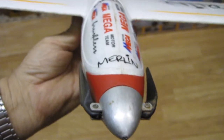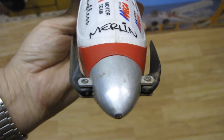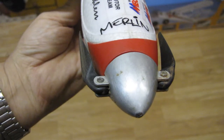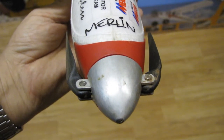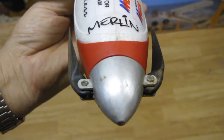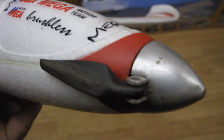The motors I've got - the specifications are Mega Motors 16-15-3 and a 16-15-4. I've used both and they both fly very well. I've got the other one in a mini XE flying wing. The 4-version runs at 2100 kV and the 3 is 2800 kV, so it's a fast motor. They're not cheap but they're very powerful and they do fit in this aircraft well.